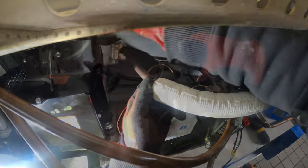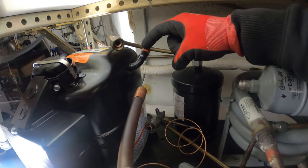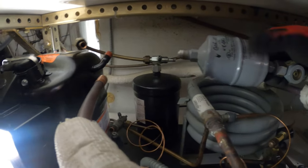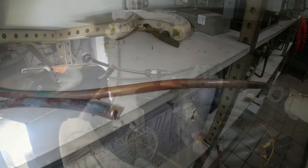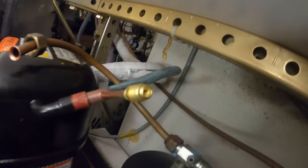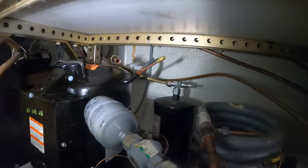We're going to cut this pipe out and make all our necessary alterations. I just cut it out — basically I need to rebuild from here to here, then connect the new filter dryer on this end. This pipe goes in here and the suction — which is insulated — has to come in here. I drilled a hole and put a pigtail so the pipe swings straight in. Much better — no fittings, no turns.